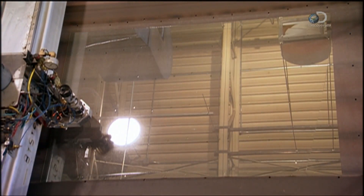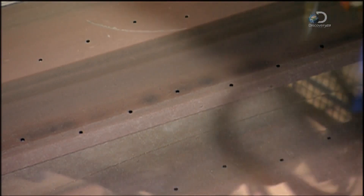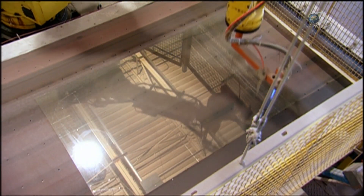To make a windscreen, production begins with a plain sheet of glass. An automated plotter moves a cutting wheel over it, and the wheel scores the glass. A robotic arm brandishes a torch. It moves along the scoreline, and the thermal shock completes the cut. It's the best way to cut cleanly through glass.